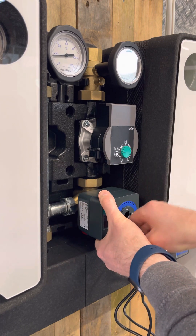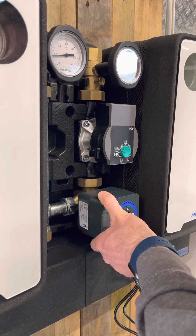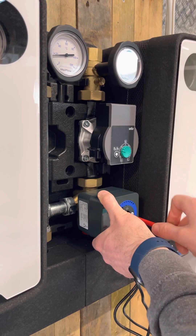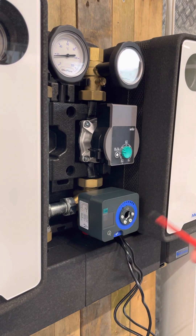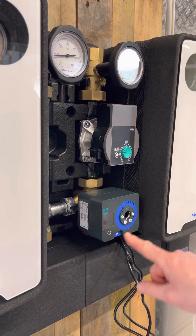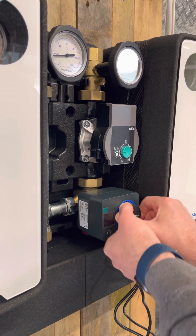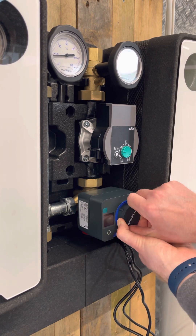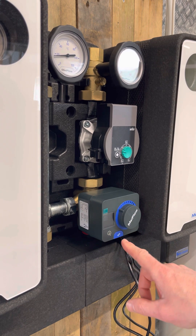Once you've got it on, take the front cap off and get the long screw that comes in the pack. That goes through the middle and you tighten the actuator head to the mixing valve - just nip it up tight, you don't have to go massively tight. Put the cap back on to test it; it does get a bit stiffer once tightened. Once you're happy, take the manual mode off - you must take the manual mode off for it to operate correctly.